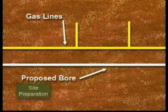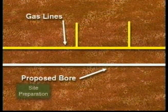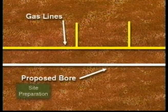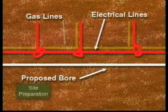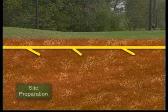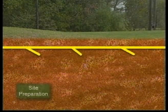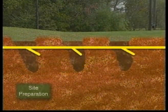owner. Gas lines may have T's, valves, and other connections, which may extend well beyond the marked location of the pipe's path. Power cables may have been installed with numerous curves and turns, and may also contain loops of excess cable where splicing has occurred. Boring parallel to a buried utility may therefore require frequent exposure of the utility and the drill head to verify the necessary clearance between the utility and the bore path.